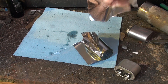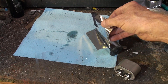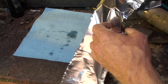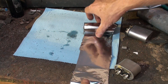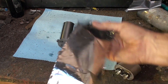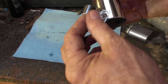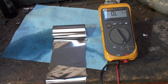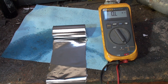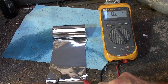Here's a piece of the insulation, and here's the aluminum foil — there's a piece of insulation between the two pieces. As we start taking this off, you can see the aluminum is very delicate and breaks off easily, but the insulation is right there. You've got this extremely thin aluminum foil and then the plastic between them. To better understand this, I've got an ohmmeter set up and I've got this aluminum foil with plastic bonded to it.